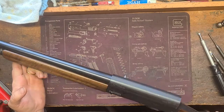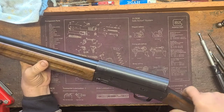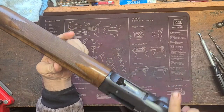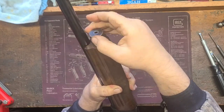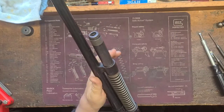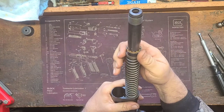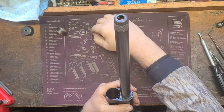Good morning. We have a Browning Auto-5 12 gauge and we're going to disassemble it this morning. First, we make sure we have a safe and empty weapon. We unscrew our magazine nut, set it to the side, take the forearm off, and the barrel comes right out. Set the barrel to the side. Now we take our friction rings off — they come off in one piece. Set those aside.